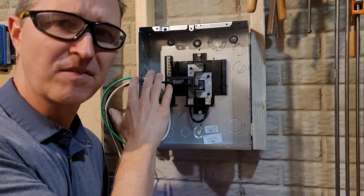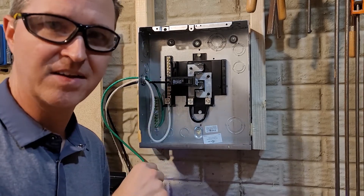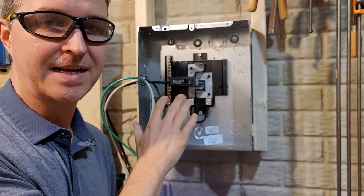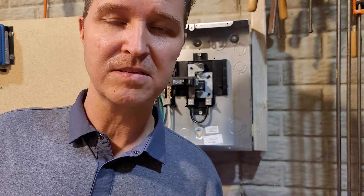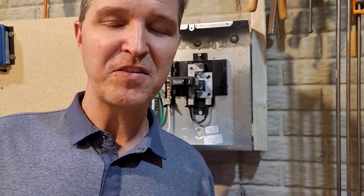One thing I don't like is that I can't turn off the whole box just by switching the breaker, because I still have 60 volts on the neutral. To be 100% safe, I will always have to turn off the inverter when working inside this box. Thank you so much for watching — I had a lot of issues with this but I hope someone learns something from it. If you liked the video please hit like, leave a comment if you have questions or if I did something wrong, and please subscribe. Thank you and have a good night.